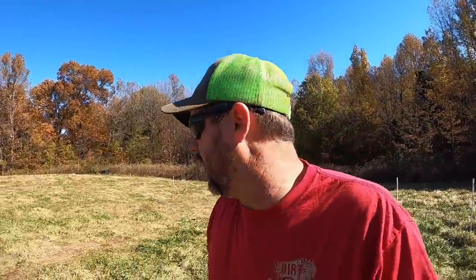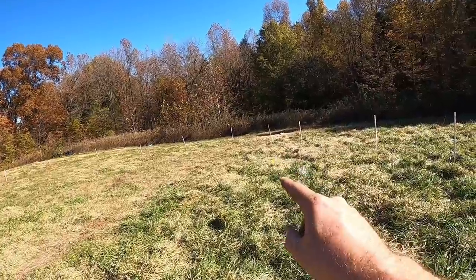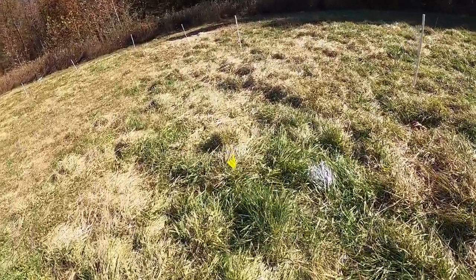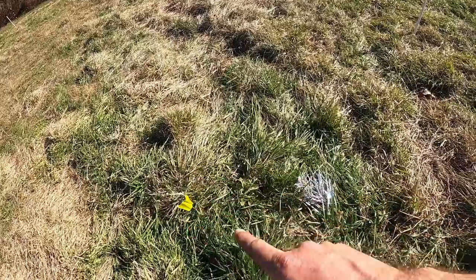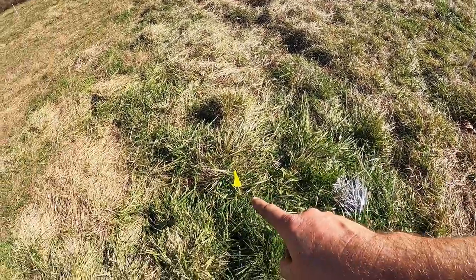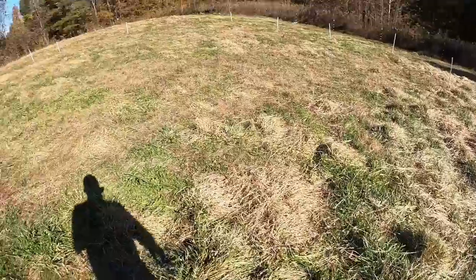One thing we have to do is we have to stay at least 10 feet away from all sewage lines that make code. And basically, I don't know if you guys can see that green flag right there. We laid this thing off once, we were over here, we didn't have our distance. So we had to lay it off again, change our angle a little bit. We got our distance here.